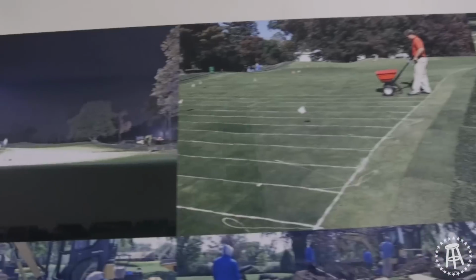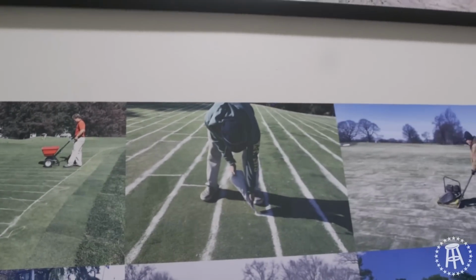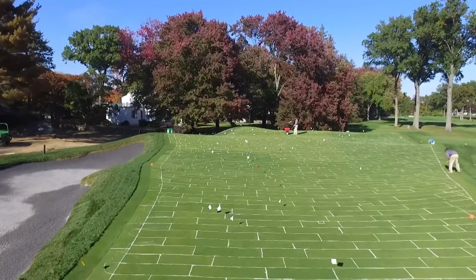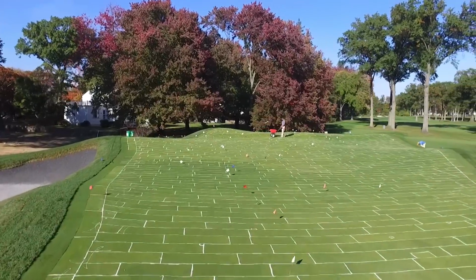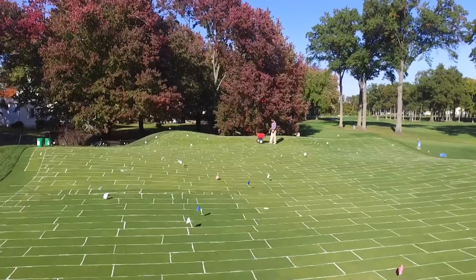So now what are we doing here? What is this? So when you put the sod down, there's gonna be little gaps. Is this grass seed, fertilizer? No, it's sand. We're putting sand on the seams so we can try to hide the seams. We adapted a machine to put sand here, and then we took pastry bags out of the kitchen and filled the seams with it.